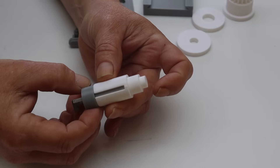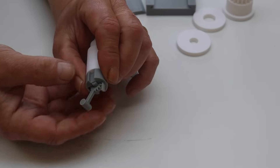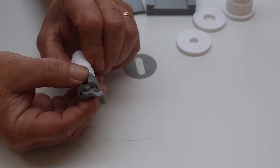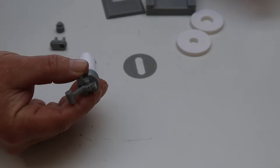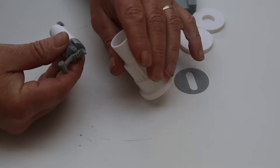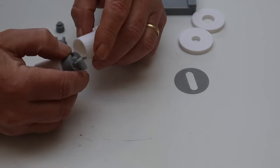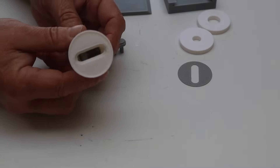The next bit is the selector - one side has an indentation and the rack goes into that indentation and presses firmly in place. If we hold that body and move it up and down, you should notice this little hammerhead is waggling backwards and forwards. That whole lot then drops into the body - it only fits in one way because of these slides. Put a spot of glue in there and drop that whole thing into the body.